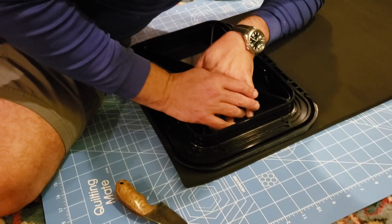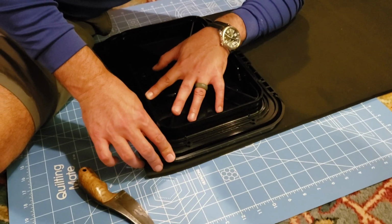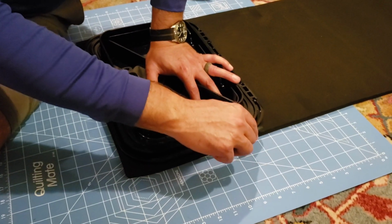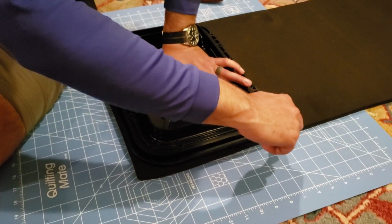All right, so what I'm going to do here is cut my gasket out of some 3/8 of an inch foam that I got from Amazon, and the link for that will be in the description. What I'm going to do is just trace around the outside of this with the knife edge, and then I'm going to cut it out with a pair of scissors.